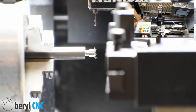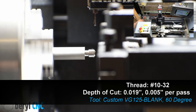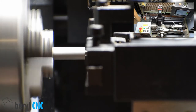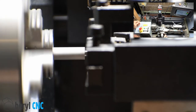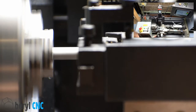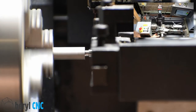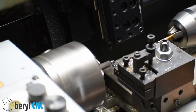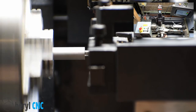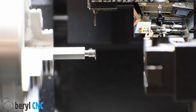Let's move our drill out of the way — now it's time to thread. We're going to take five-thousandths passes with our vernier set to zero at the OD of the threaded area. Five thou — back it out. Ten thou — back it out. Fifteen thou — back it out. Nineteen thou — that's our spec. Back it out. Now let's do one more finishing pass at 19. Let's disengage our threading and flip our direction.